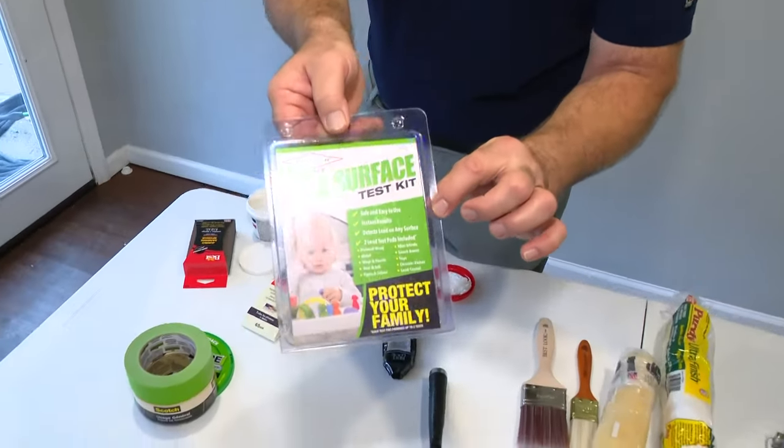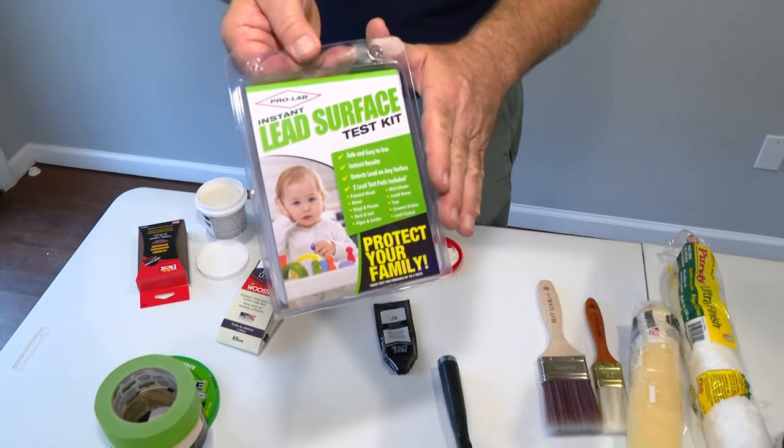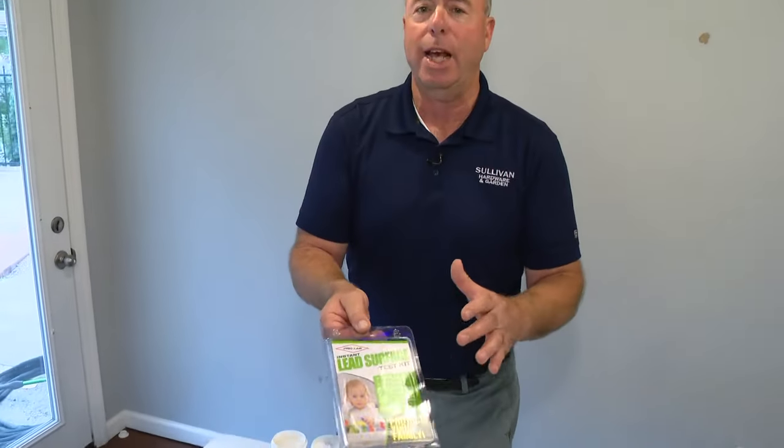Remember, just a little side note: if it's a really old house, don't start sanding. If you have lead paint underneath there, you want to make sure it's encased. Don't get into an aggressive sanding in an older home without testing first. If you do, go online — there are all kinds of ideas on how to remove and how to encase lead paint. A great time to get inside and get ready for the holidays.